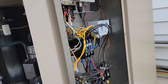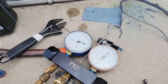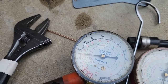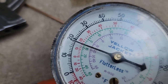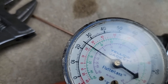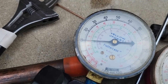Okay, we got the new switch mounted up there. Ran it through — wire tied, loop-de-looped, nylog'd. So I've got my analog gauge here, got it pumped down at the valve. Open her up — got her about 23 to 25 area. That's negative 8 to negative 10. Let's see if it comes on here. Come on now — there we go. Now we're going to crank it in and make sure she shuts off in a positive. I always had a long line set, I'd rather it go a little bit lower but I do not want to go into a negative.